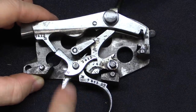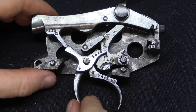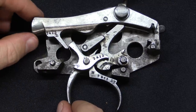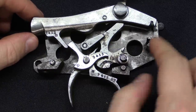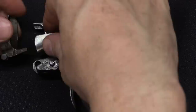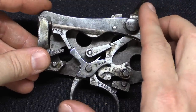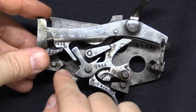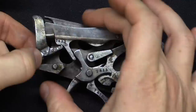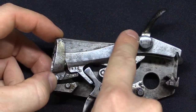After firing, to eject the round, you push the front trigger forward until the locking bar no longer supports the breech block. The V-spring at the back expands, pushing the breech block down. As it comes all the way down, it hits the bar coming off the extractor, which snaps the extractor back and throws the empty case up the little ramp and out of the gun. It is truly a really cool little system.